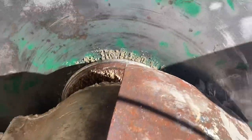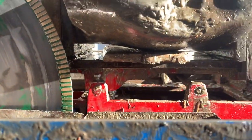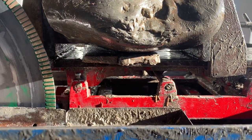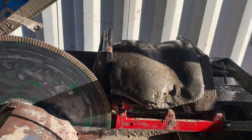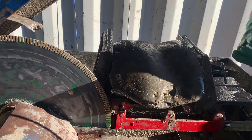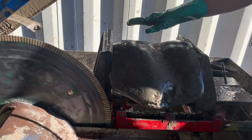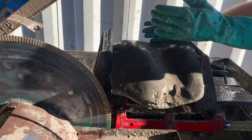Every cut that's set up, you have to be mindful to use the tolerances of the saw properly. So I can see from over here that we're definitely above the flange washer. And then the next thing to do is make sure the board itself is not gonna hit the washer. And I think my final orientation, to make the biggest slices through the center and middle parts of the rock, will be going this way. So after this end is taken off, I can then turn my stone.